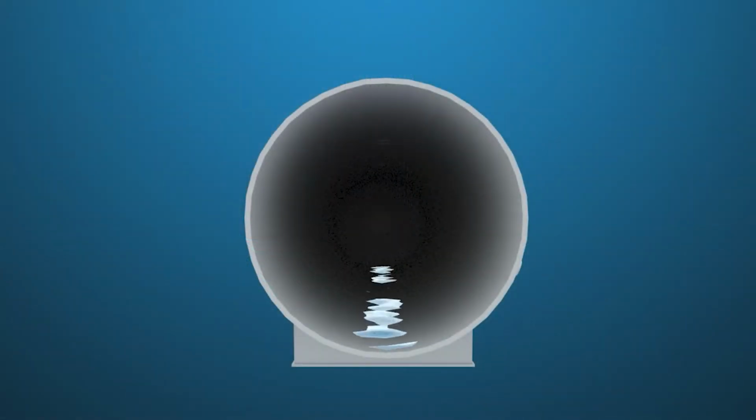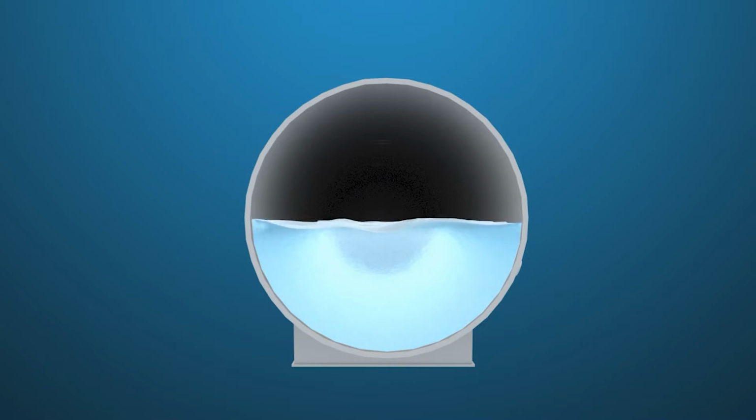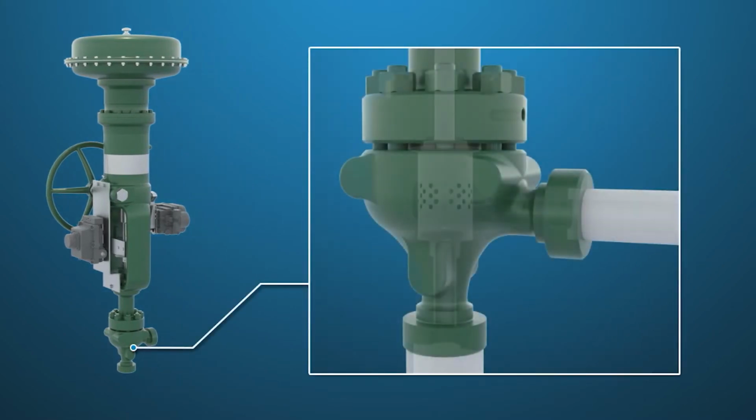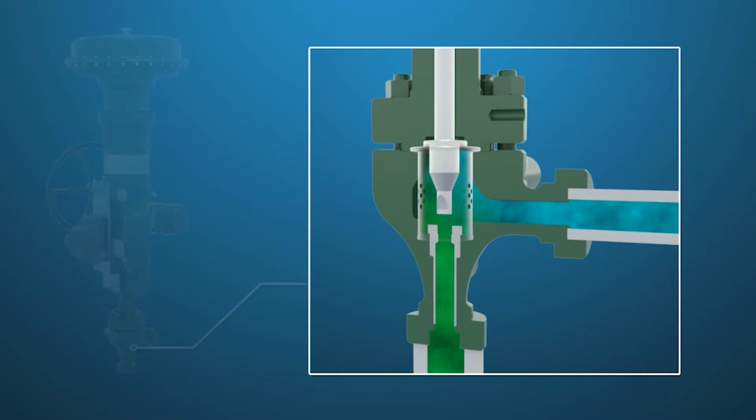If the leakage rate becomes high enough during startup, the leakage flow can cause the drum level to increase uncontrollably. This is an undesirable operating scenario, and the only way to maintain the drum level is to blow down the extra water. This is costly as it is a waste of water and heat. If the leakage becomes high enough, it is possible that level can still increase uncontrollably, even though blowdown valves are open.